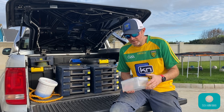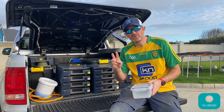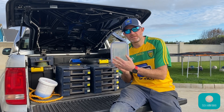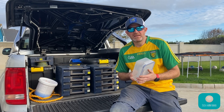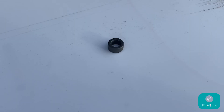As well as that, when I'm building this antenna I actually want it eventually to become a fan dipole — a dual band dipole for 20 meters and 40 meters — which is why I have this box. This is going to be the center point of the antenna. I'm also going to build a 1:1 balun today to help out with any radiation from the feeder to the antenna. So let's get to it.